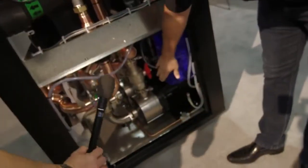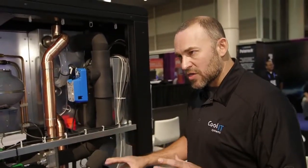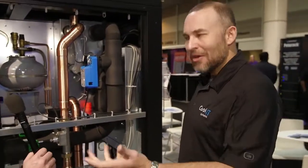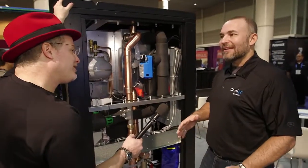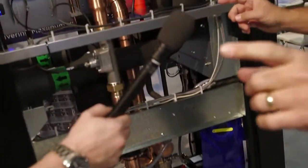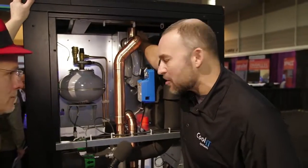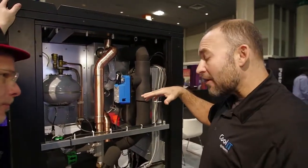This unit is capable of doing a little over 350 liters a minute. It has large pumps, and only one of them ever runs at a time — you always have one as a redundant backup. Once a week they switch, so you don't have the problem of a backup that hasn't been started in years. We want to make sure they have the same wear life and are always in commission — and that if one fails, we don't find out the other one isn't working either. It has all the same sensing technology as the CHX 40, on a grander scale.